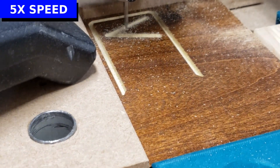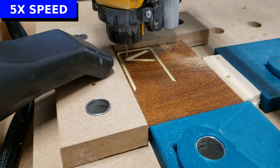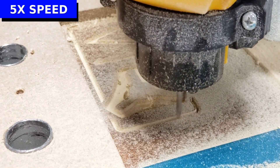I did have some issues with the F-Engrave one — when I glued it together I think I had it a little bit tilted because I used a 60-degree cutter. I do believe this 30-degree cutter helps the parts fit together better. So I might try using the 30-degree cutter in F-Engrave and see what the outcome is.